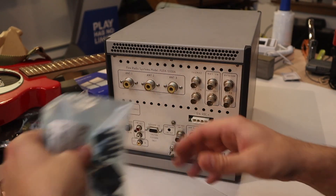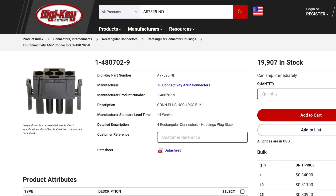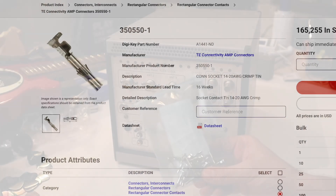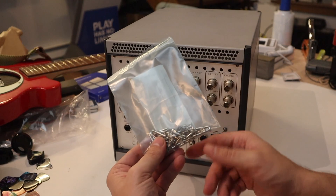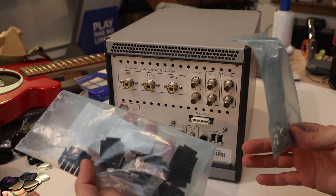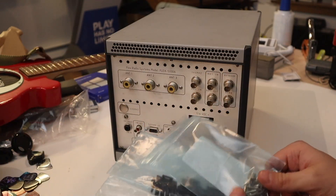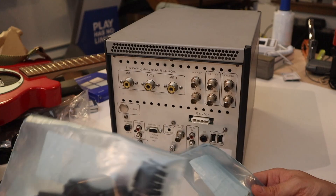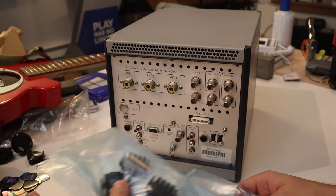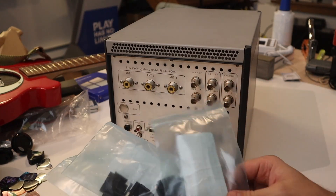You have to order the plastic piece that you actually make the interconnection with, and then separately — thank God for DigiKey and companies like them — they had a cross-reference showing if you have this connector, you're going to want to use this type of pin for it. I ordered a bunch of these. I only need one, but they're like 20 cents a piece — if you're going to make an order, order a bunch. You're going to have a buddy that breaks his, or you might want to fab one up for your car, or have one in a different part of your house. At that price, just buy 10 of the things and move on with your life.